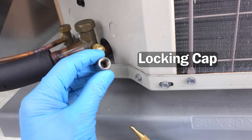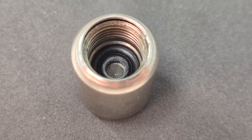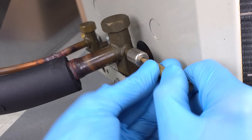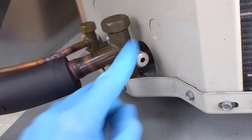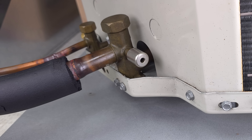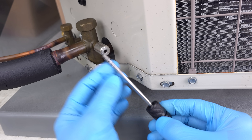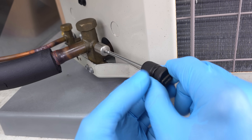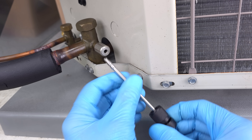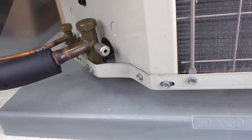In our case, we're going to be installing a locking cap, and this one also has a rubber O-ring inside. We're just going to use this tool to screw it in. You want locking caps on any accessible ports to avoid somebody from accessing it and stealing the refrigerant for any nefarious purpose. This particular locking cap manufacturer uses the end of the rod of the VCRT tool to tighten it — it's the key for it. But manufacturers may use a variety of different key ends, so you want to have them ready for servicing any type of unit in the field.